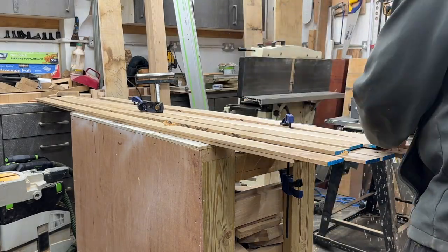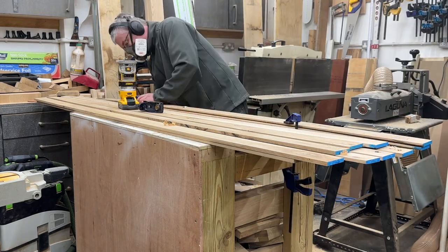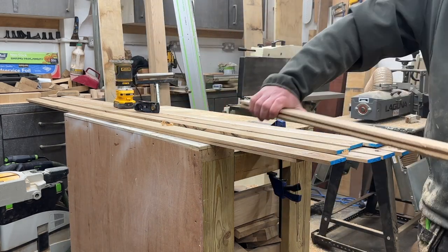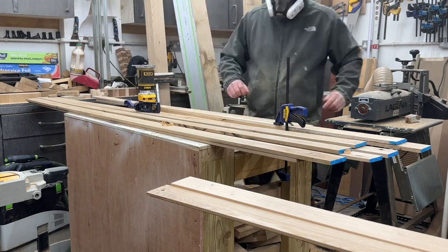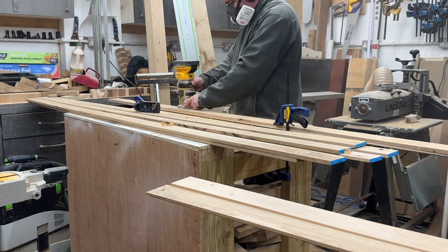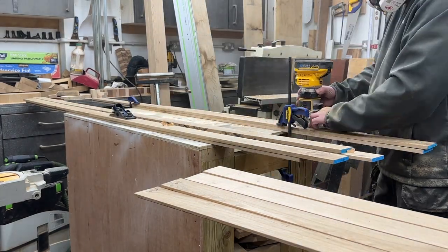At this point I've machined all the timber into slats. I use a rebate bit — or rabbit bit — along the edge to create a half-lap. I set the depth accurately so each side of the profile is half of the other, then rout each edge so the slats can overlap. This is the main infill on the door. I then use a chamfer bit on two edges to get a V-groove running from the head of the door down to the floor — a very distinctive feature.